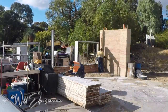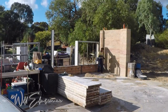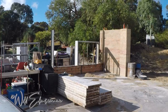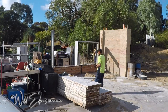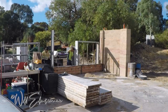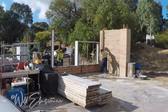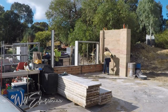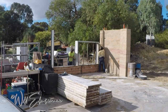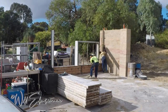It's only a very small pillar so it's not too hard to just shovel it straight off the ground. There are rods into the concrete in there because even though it's small, it's going to link in with the keyway — look at the keyway video for how to join walls. We're also putting rods in to strengthen that pillar because it's quite small and there's a high likelihood it'll get knocked by bikes, motorbikes, quads, or pallet trolleys.